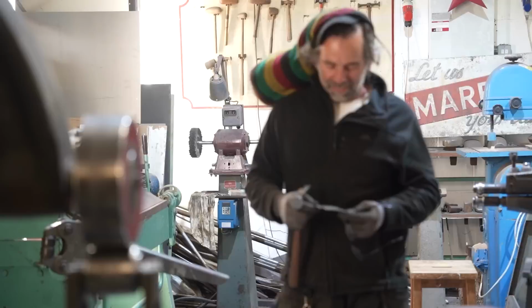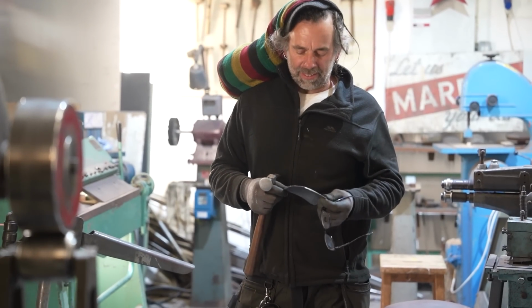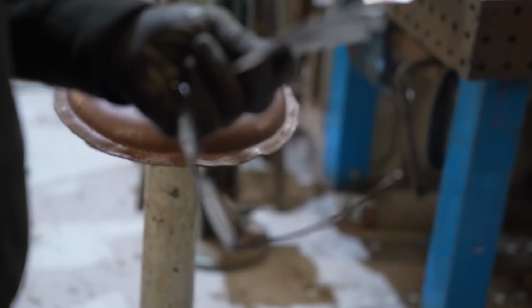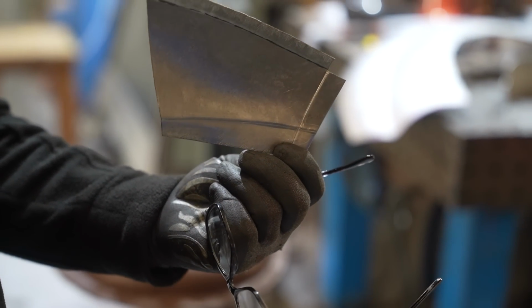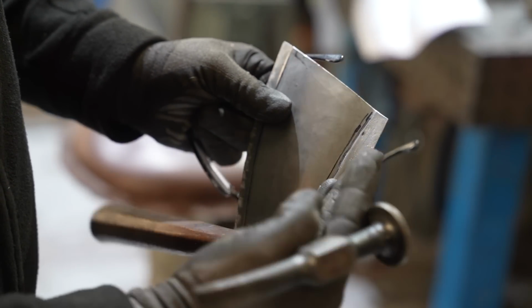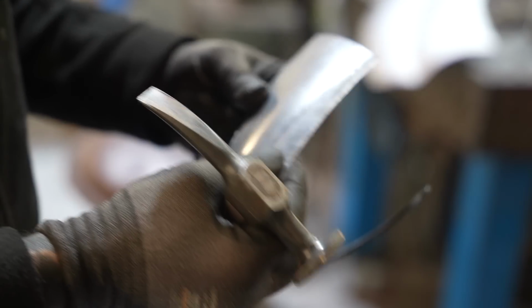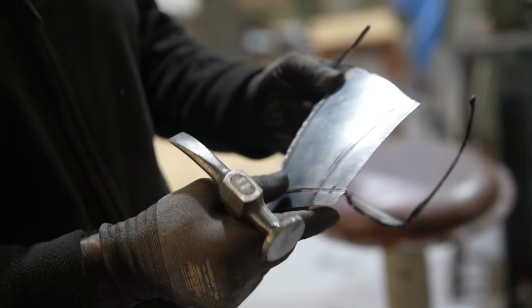Okay, good. It's nice to have all the equipment to have a play with. And learn. Definitely playing. It's got a lot of shape to it now. Look how much is going on with that. We've got to tip that round. This one's got to come back. That one's flared out. It's a little bit flatter there than I'd like. It's flat at the bottom, but we've got a bit of curvature at the top. We've got curve this way as well.